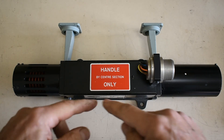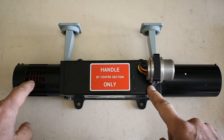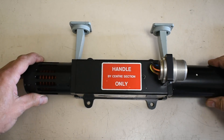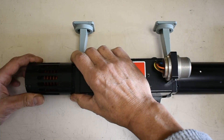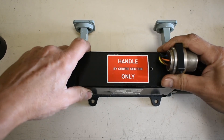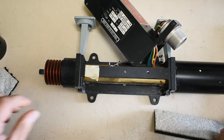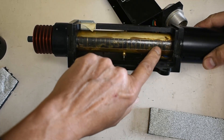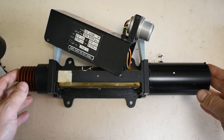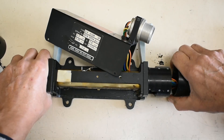The way it's constructed is there's an electron gun inside here, and a beam will travel up through a tube, with the anode located at this point on the tube itself. We can have a little look inside. There's a centre tube here with a lot of magnets along it — the function of the magnets is to keep the beam collimated. Our electron gun assembly is in this end of the tube, and I've actually taken the whole tube out of here already.